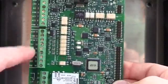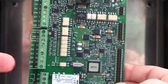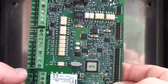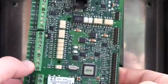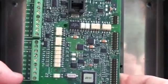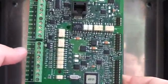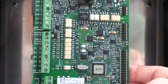There's an open circuit between terminals 10 and 16. It could be 17, 18, 14, or whatever one you've got there. All these are programmable, so you have to look to find out how your drive is programmed. But typically it's DI4 terminal 16 and 10 that are open. That's assuming you're sourcing your voltage for your start stops and everything like that. You can tell that if you have a jumper between 11 and 12. Also, if that jumper is missing, that will cause this too.